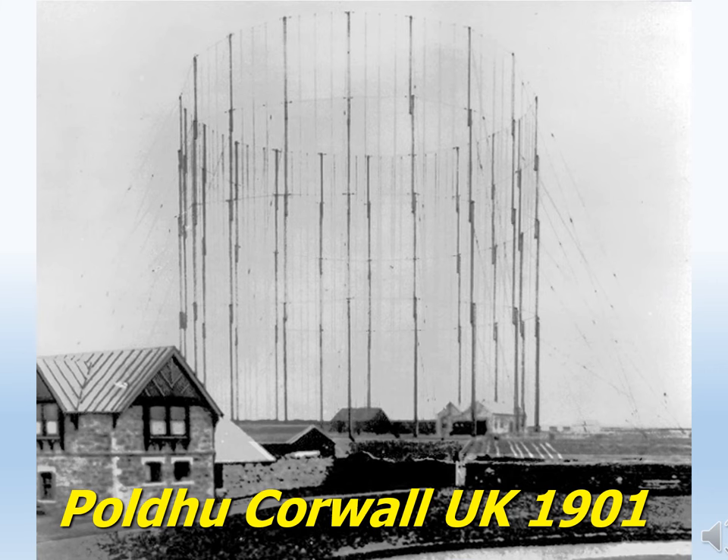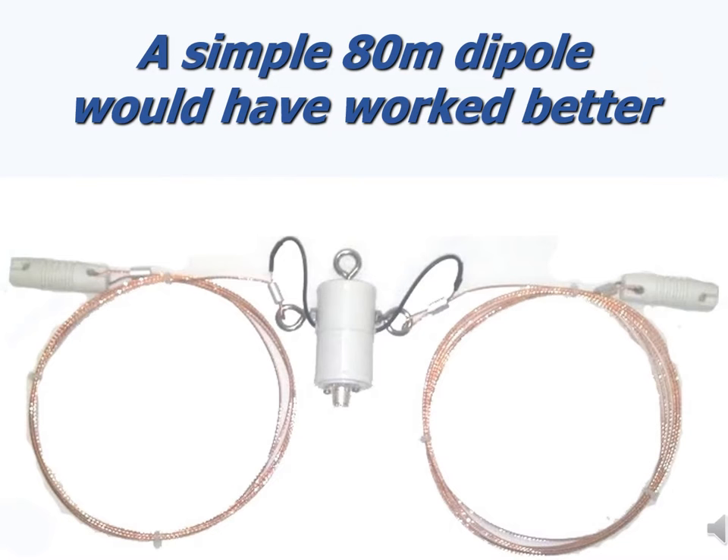In fact, these two famous radio pioneers — Nikola Tesla and Guglielmo Marconi — didn't know either. No one then did. So it's not strange that some hams today still don't. This is the massive non-resonant antenna that Marconi erected in the UK and used to send three dots across the Atlantic by radio in 1901. He put up this monster simply because no one in that day really knew much about antennas — they only knew to put up as much wire as possible. Ironically, had Marconi understood the difference between a resonant and a non-resonant antenna, a simple 80-meter dipole would probably have worked better than his giant non-resonant creation.